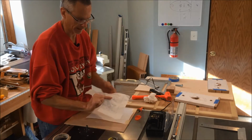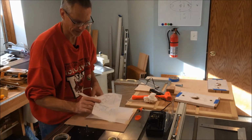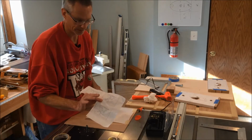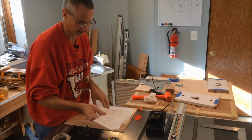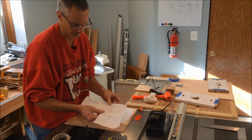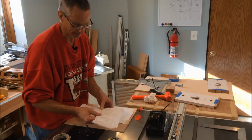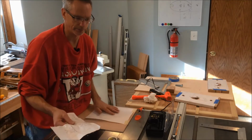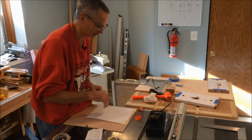This is my little logo that I put on some of the woodwork and some projects I've done. It's basically mirrored over, but I just printed it out on a laser printer and it seems to work pretty well. I've had more success rerunning it through the laser printer multiple times. You get a little bit of registration issue, but it seems to help, because you want to get more of the toner onto it so it transfers better. It works okay. I would not use it for something I was going to sell or even probably give away. I just use it internally for my shop.